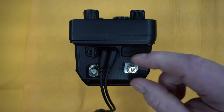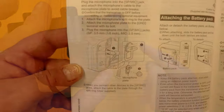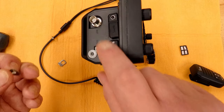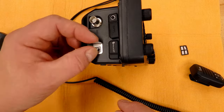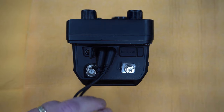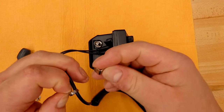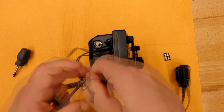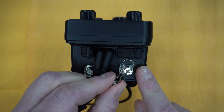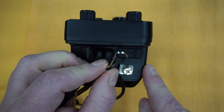Here you have the ground connector. There's also a little clip that you can install that comes in the bag with the radio — I went to look for it after I opened up the radio. This clip is for securing your microphone connector so it won't break if you accidentally pull on the microphone wire. Tip number one: if you ever went to Dayton or have a co-card from a hamfest, you know the kind of necklace clip they give you for your pass — that's the kind of clip you'll find here.